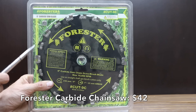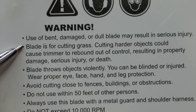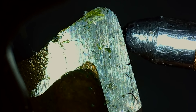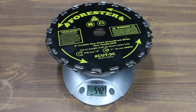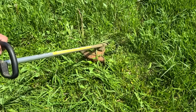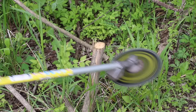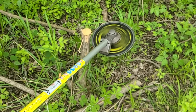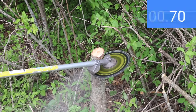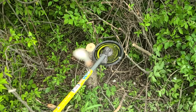At a price of $34 is the Forrester chainsaw carbide blade — 9-inch with 20 teeth, ideal for all brush cutting applications, made in China and weighing 542 grams. The large chainsaw cutters helped it perform slightly better at dispersing grass clippings compared to blades with carbide teeth. The chainsaw teeth slung wood chips everywhere as it ripped through the 1-inch sapling in a fraction of a second. The 542 grams of weight helped maintain momentum on the 2-inch sapling as the thick cutters shredded the tree. The Forrester made the third fastest cut at 2.42 seconds on the 3.5-inch tree, though it takes a lot of power to keep those thick cutters moving.